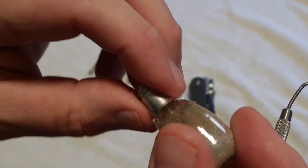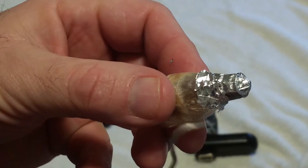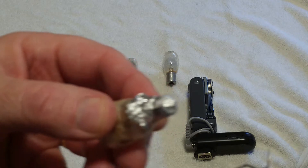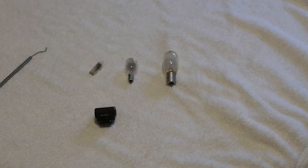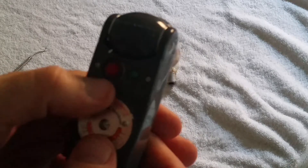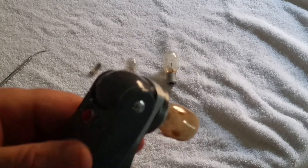That's what happened — it's like the old game Operation. So what I did was take some aluminum foil and wrap it around the base of the bulb, shorting it out from the center terminal, which is normally isolated from the rest of the base. Now you can put this into the flash unit and it will function as if it's a good bulb. This let me check the voltage without burning bulb after bulb by slipping off the terminal with that dental pick. That's just side information — the important part is reversing the battery and capacitor.